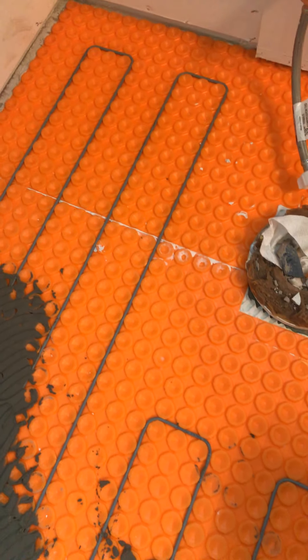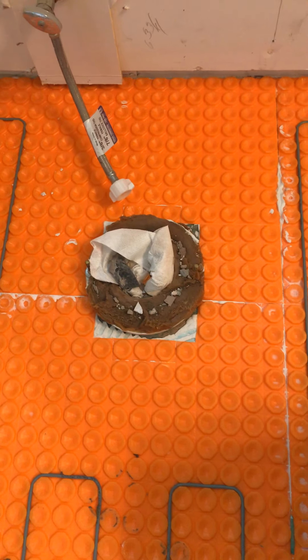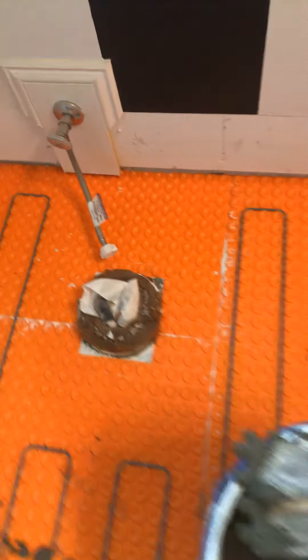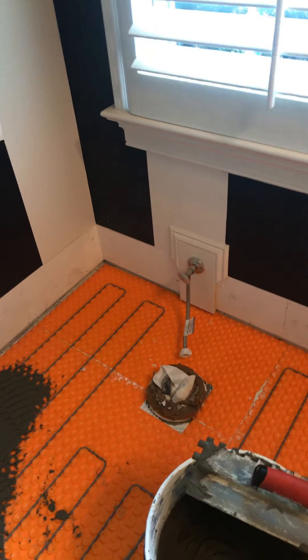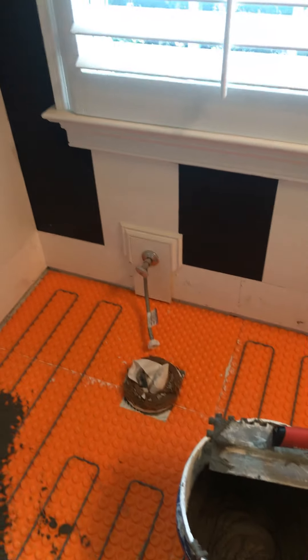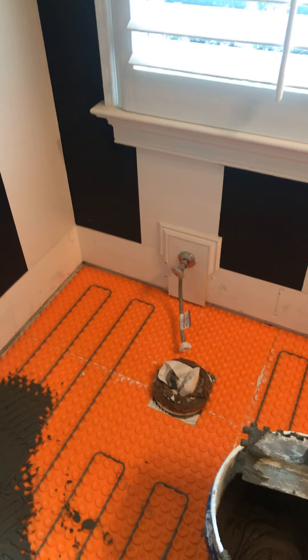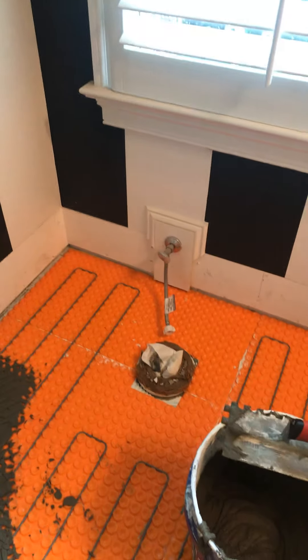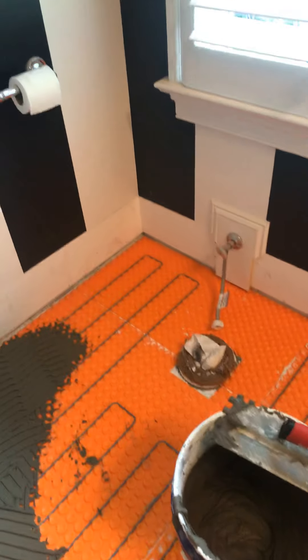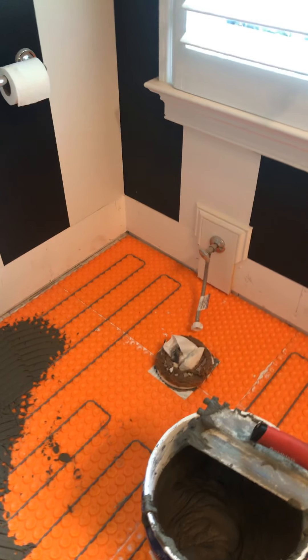You're going to keep it on a three-space. You want to keep it six away from your toilet flange on all sides — that would be six of those little dots. You want to leave that away from the toilet because you don't want to heat it up. That would make the water get hot and stink even worse. It may also cause it to crack with the floor heating up and cooling down repeatedly, since these little coils get fairly hot.